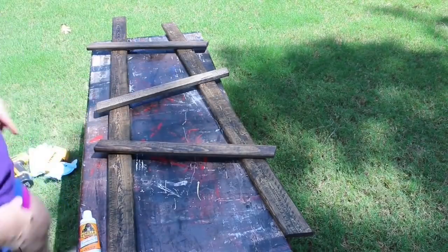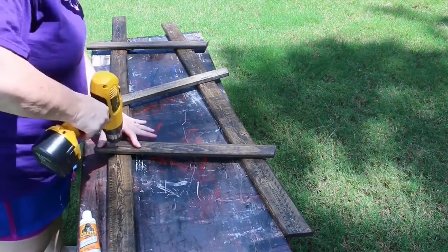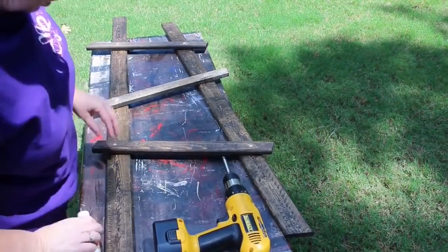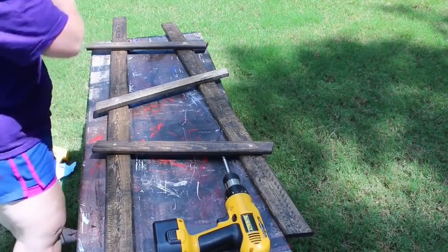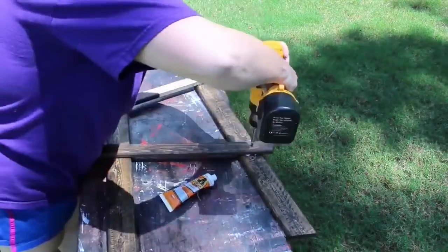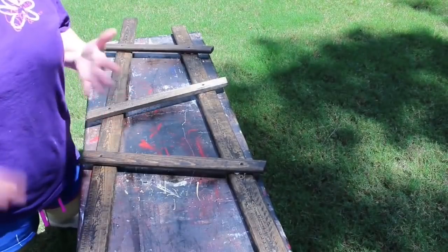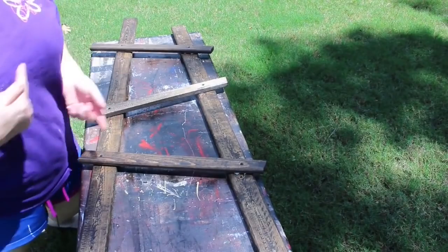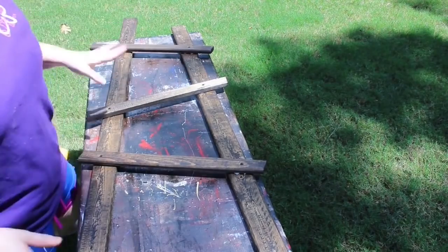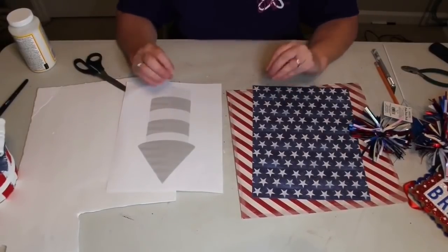Once I get my pieces in place I take my 18-inch slats and lay them out at an angle as well. Now I'm going to use my drill and drill some pilot holes into each end of my slat so that it will help my wood screws go in easier. Then we use our Gorilla adhesive glue and put that under it and drill our screws into our slats. You can see the screws but that doesn't bother me - I like how rustic it makes it look - but you could totally cover that with some putty and stain if you didn't like it.